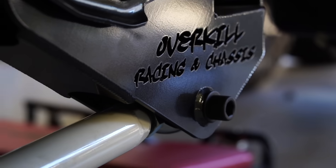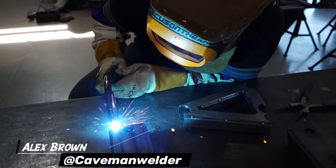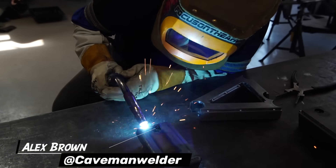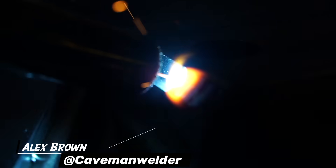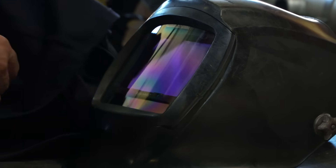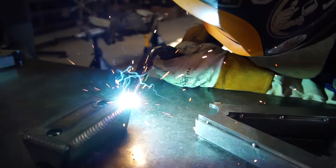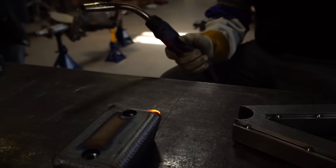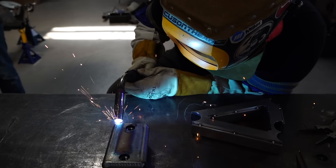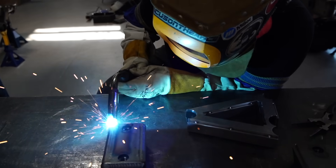And Alex, I know you do a lot of pulse spray work. If you were to be welding this open corner compared to the settings we would use, how much would you change it? Well, as far as the layout of the machine, it wouldn't be a voltage and a wire speed — it would be a wire speed and arc length. So the machine setup's a little different. The mode of transfer is quite a bit different. The technique itself is actually pretty similar to what I do whenever I'm trying to get that real nice stack of dimes. It's a really different process from what I'm used to, and so I can't speak much to the short arc aspect of it, but Brad did a really nice job on these. These look as good as I've ever seen from anyone. I'm impressed.